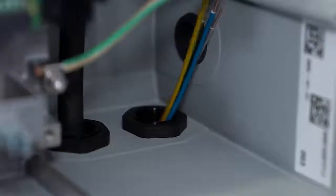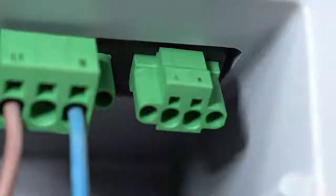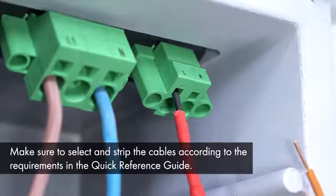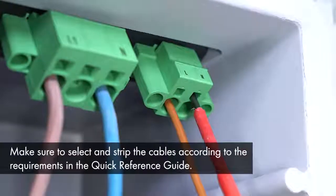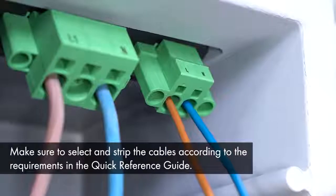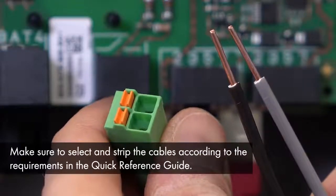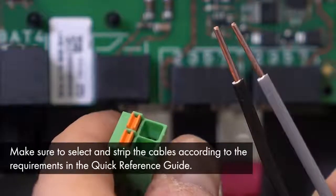Please insert the cables through the intended cable gland and connect them to the plugs. Also here, connect the AC secure power supply plug to the inverter first. It should be tightened with a 3.5 mm flathead screwdriver. The grounding conductor must be connected to an equipment grounding terminal as well. The plug that's connected to the switch is still missing. So connect it to the inverter at the communication assembly. Make sure you hear an audible click when connecting it to ensure it's properly installed.